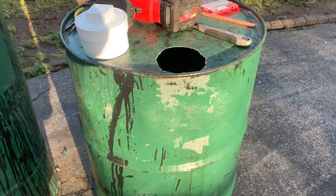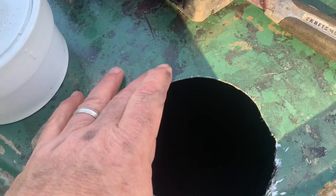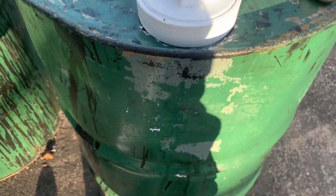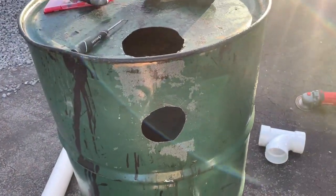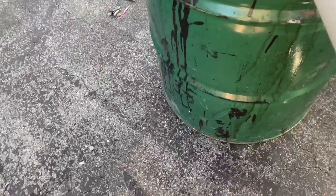I've started my home septic system. I took this jigsaw right here, cut a hole in the top of this 55-gallon drum, and this will be where the cap goes, just like that. You want to unscrew it and load it in. Then I'm going to put another hole right here — this will be the connection between that tank and this tank over here. I've got the hole drill right here, and this connecting pipe will be a lot shorter, maybe about two or three feet. I'm going to drill a hole in that one, connect the two pipes, and then silicone them together.